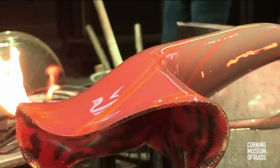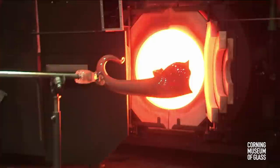And again, the annealing cycle, the slow cooling process, I'm assuming we'll put this on a 24-hour run. So from 900, 24 hours to gradually come down to room temperature. That time frame is really based on how thick or large a piece of glass is, thickness primarily.